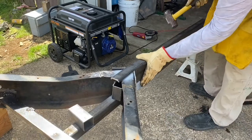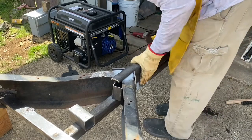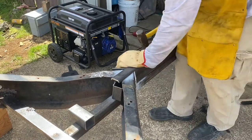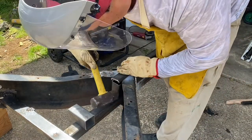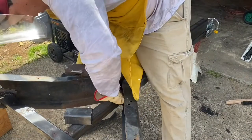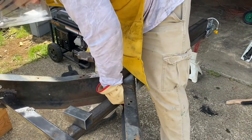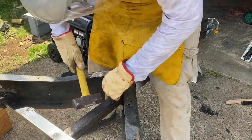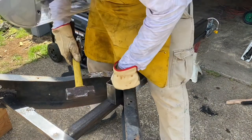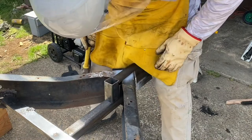Now I've got all my pieces cut, it's time to do a little dry fitting. This big piece — I was really impressed how well it went together. The welds on top gave me some grief where I did the last repair, but I figured if I weld the tube together and come back, I can hammer that down and flatten it over the other beads. I'm lining up some support — I've got a couple pieces of tubing underneath the front of the tongue to stabilize the long arm going forward and give the tongue a lot more support. I'll weld all that together and then weld the top on.